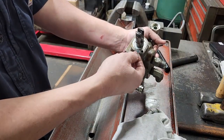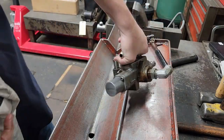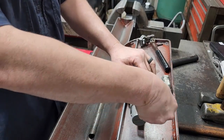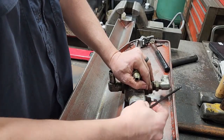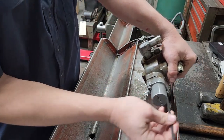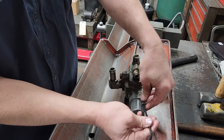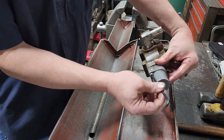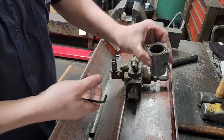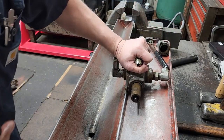Somebody looks like they've been in this before — this looks like silicone, possibly. We'll find out once we get into it. Now go to the back side and remove the cap off the back end of the spool. This houses the detent, which is the issue — it's not detenting. If I were to guess, it's probably all gummed up; maybe the ball bearings are worn and the sleeve for the detent might be worn from excessive use. We'll remove these allen screws and remove the cap. This thing is completely filthy, dirty, and rusty.